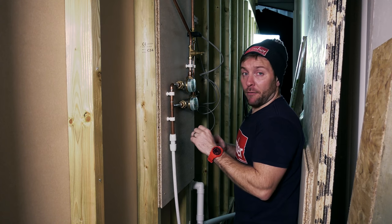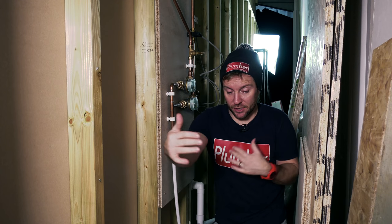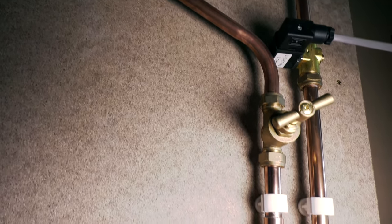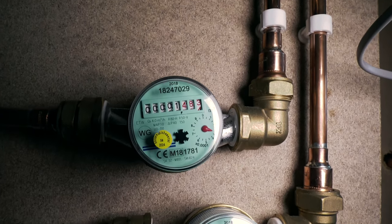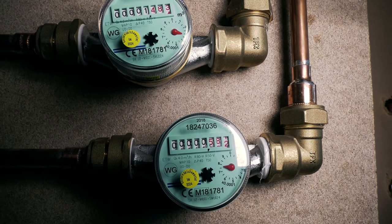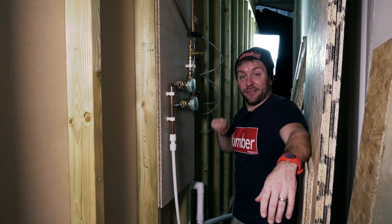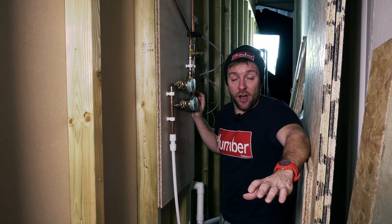The readings on these are in meters cubed. What we're talking about is if you imagine a meter cubed of water. So the IRC valve here used 0.582 of a cubic meter. So just over half of a cubic meter in 24 hours. Get this, guys. The drip type, which is running at literally exactly the same flow rate and everything as the other one, was running at 1.483. So in 24 hours, it's used nearly a whole cubic meter more. So we've saved almost a whole cubic meter in 24 hours using the IRC valve.